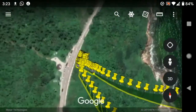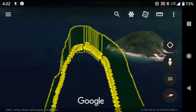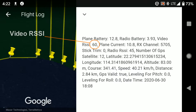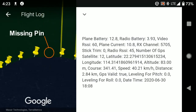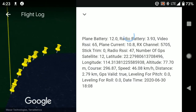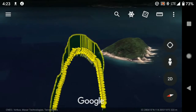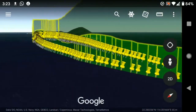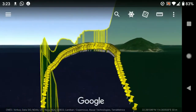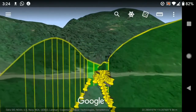You can see where to fly next time to avoid noisy areas or buildings that may interfere with your drone. We flew from the glider sport field in Clearwater Bay, Hong Kong to an island 2.84 kilometers away. At the farthest point we still had 60 for the video channel and 45 for the radio channel — I could have flown farther, especially at a higher altitude, but had to turn back due to low battery. Here you can see a missing pin — this is where the ground station didn't receive telemetry data for longer than one second. During that one second the control data was still well received by the drone, but you just don't know the number, which is believed to be between 45 and 55. With a radio quality number as low as 30, your drone is still receiving 100% of your control signals because it oversamples stick movements and sends them multiple times. You can also export the flight log to a spreadsheet, which is very useful if you are a designer for drones or RC planes.